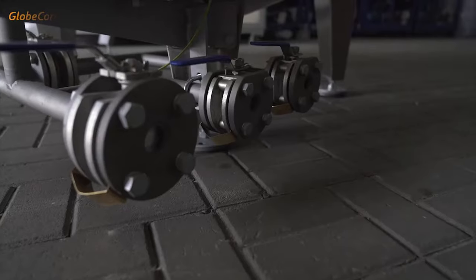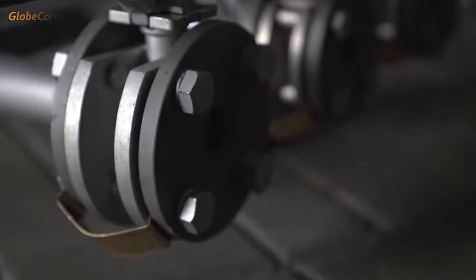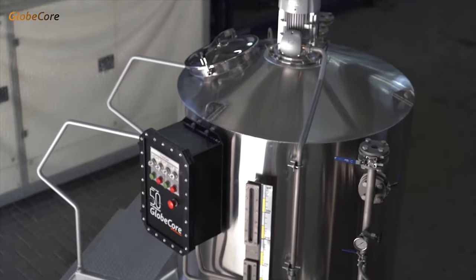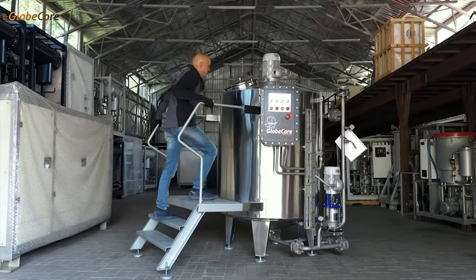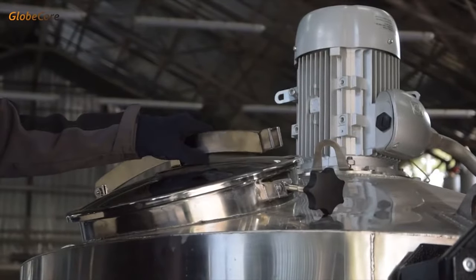water solutions. The design allows for mixing of 2 to 4 liquid ingredients required by the product formula. The ingredients are portioned by a pump into a vessel with an agitator installed inside. If necessary, the number of possible ingredients can be increased. It is possible to add dry ingredients through a loading hatch.